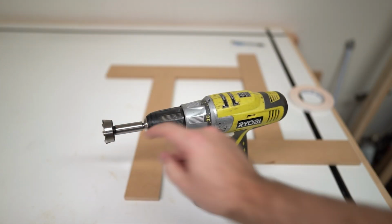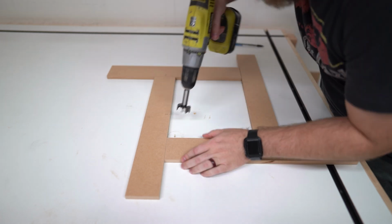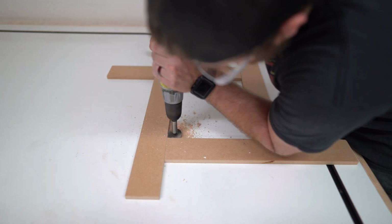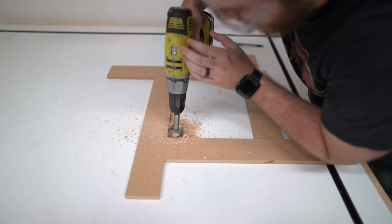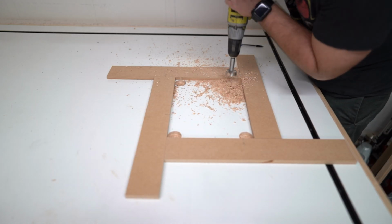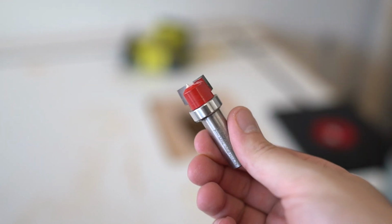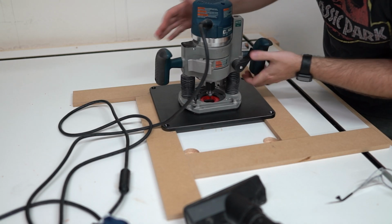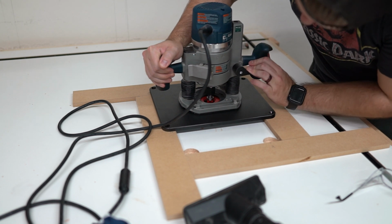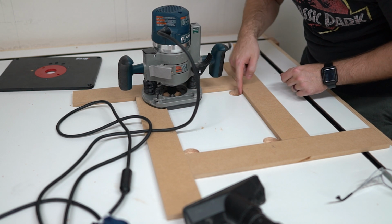Then I used the recommended 1.5 inch Forstner bit and lined it up using the corners of my little MDF guides here. So you want to go straight down. I think it's 3/4 inch. Double check, make sure, because your plate could be different than mine. So double check to make sure you have the right radius for the Forstner bit and then the depth as well. But I'm going to be using this router bit and I'll include this in the description below if you guys are interested.